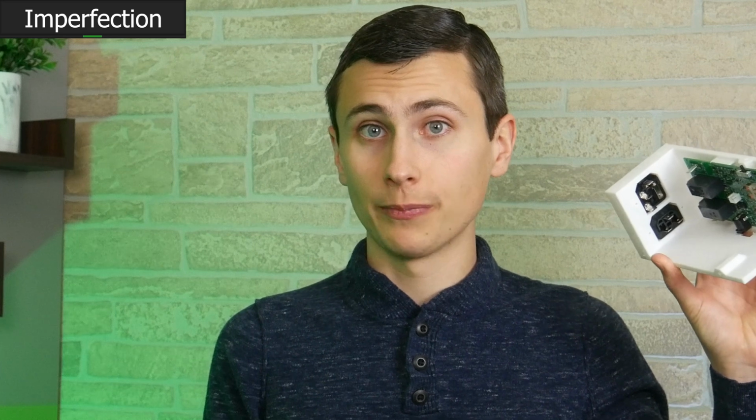Before I get too far into this video, telling you about how I can finally sleep at night, all my problems got fixed, my dog came back to life, and I won the lottery, I need to share something very important. This device does not address every hazard of 3D printers. For example, some 3D printers don't catch fire due to thermal runaway, where heat is added to the hot end or the heated bed excessively. Sometimes fires start because of arcing and loose connectors, a wire coming loose within the printer itself, and I'm sure there are many more ways that these 3D printers can fail catastrophically.